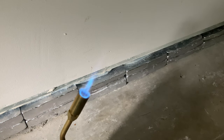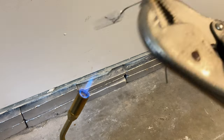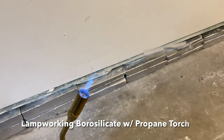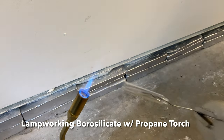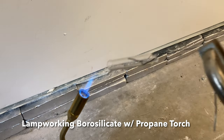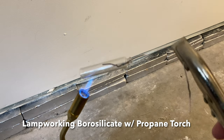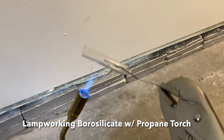Now we're going to turn this flame up, and at first we're just going to gently heat the glass by stroking it over the flame, because we washed the insulin out of the tube and we don't want to crack the glass. So at first we're going to feather the glass just to gently warm it. What you're going to see is over time all the moisture inside from either the insulin or the water will evaporate, and you'll smell a little bit of residue from the insulin that was in there — that's perfectly normal.